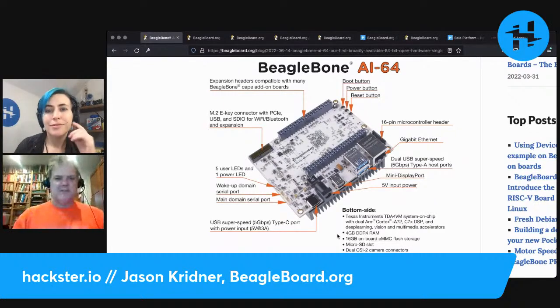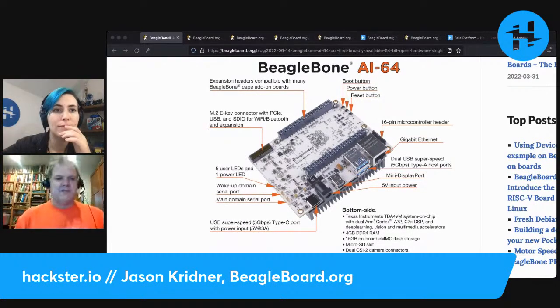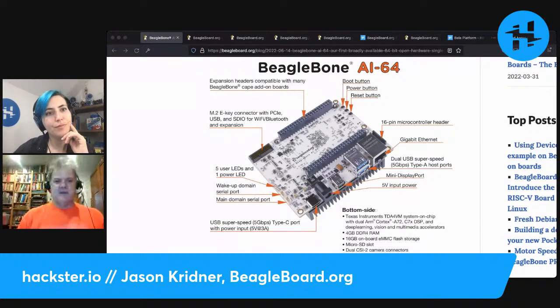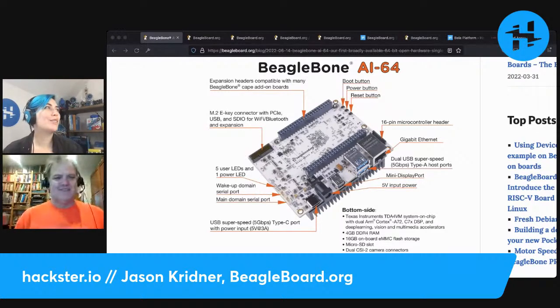And if you want to go crazy in that, you can actually isolate it and run the R5s in lockstep so that it'll even be resilient to gamma ray bursts. Nice. Yeah, so it'll generate exceptions, and you can handle exceptions if one of the processors was to get a radiation burst and actually execute the wrong instruction. It'll generate an exception, and you can handle that exception. So it's got some stuff in there for that. We don't expect the majority of do-it-yourselfers to get in that deep. Yeah, for some reason, I believe that the majority of that type of stuff comes from the sun, right?